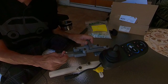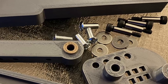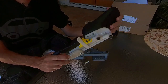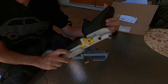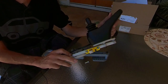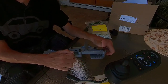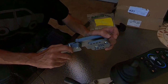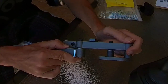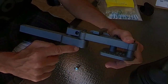On the new design I use these screw barrels instead of a nut. On this old one there's just a nut holding it in, so there's not very much material supporting these shoulder bolts. On the new one I use this screw barrel that goes in like that, so there's a lot more material for the shoulder screws to grip onto.